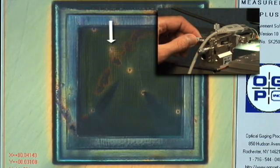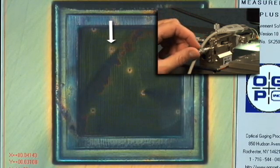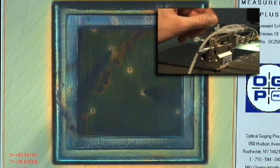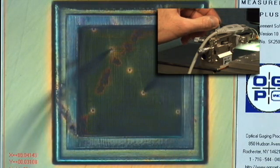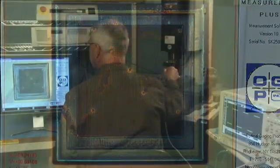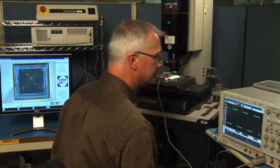With the longer wire in place, move the micropositioner in the XY direction to move the short wire into the second well. Then adjust the positioner in the Z direction to carefully land the tip in its well. Stop once the wire flexes. If the IC is active, take care not to cross the two fine wires or allow them to touch as they flex while making contact in the wells. Shorting the two wells together could permanently damage the IC. You are now ready to make your measurement with Agilent's N2884A differential probe.